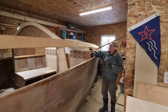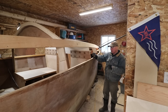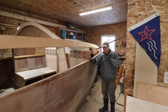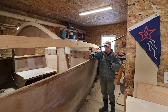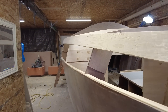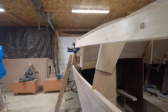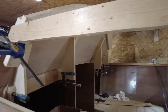The next thing I need to do is notch in a one-by-two piece of pine that will follow this shear the full distance. The reason for that is it will give us the same curve we currently see between the bulkheads and it'll give me a really nice gluing surface for the cabin side to go on to. I debated whether or not I should do that pine because it's a fairly complex procedure to level it out the whole way — not impossible. We'll be using epoxy and with its gap-filling properties, that will make it a whole lot easier.